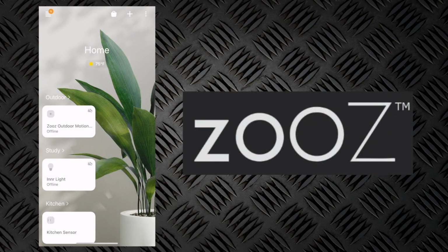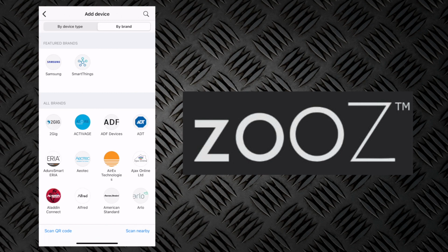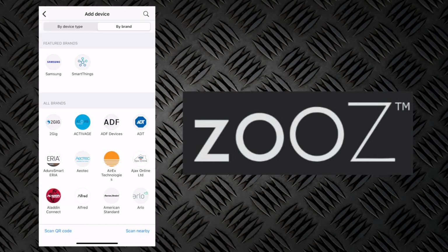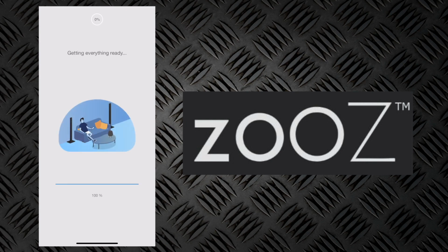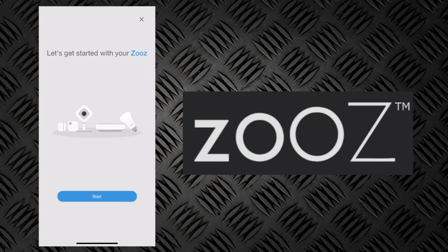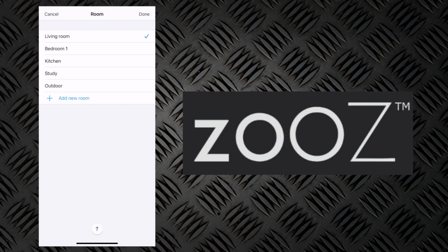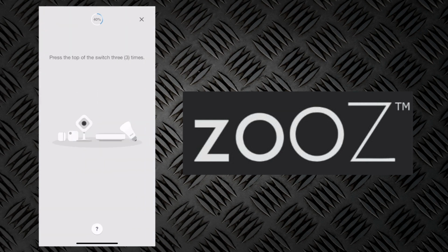Let's jump over to our phone now and get this thing set up in the SmartThings app. So here we are on the SmartThings app. We're going to go ahead and do a search for brand. We'll look for Zooz. Select that one. Let it go through its whole little setup and find the device. Hit the top of the switch 3 times to put it in pairing mode for Z-Wave.